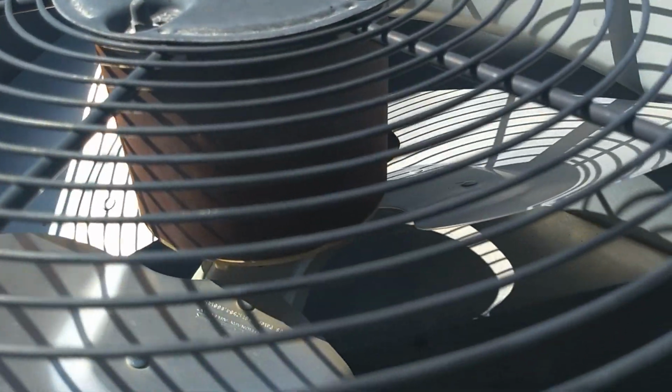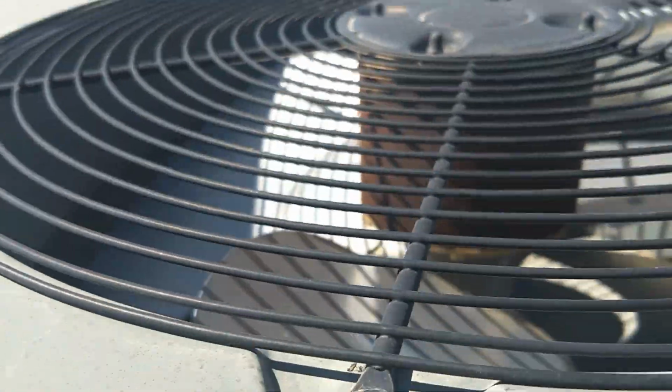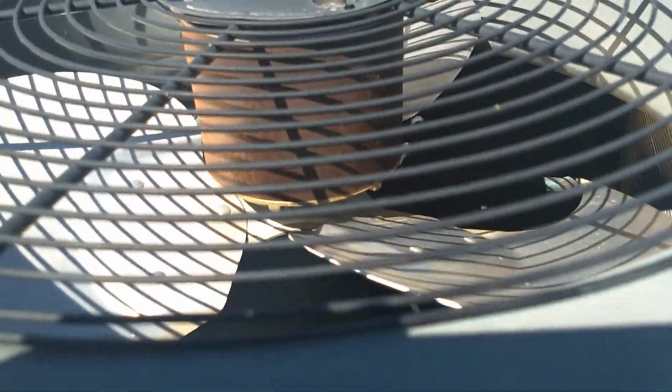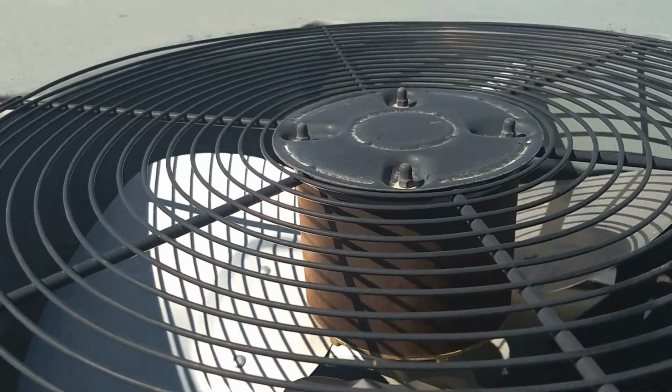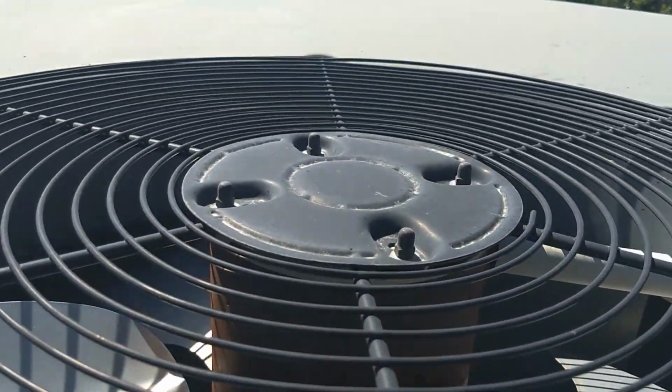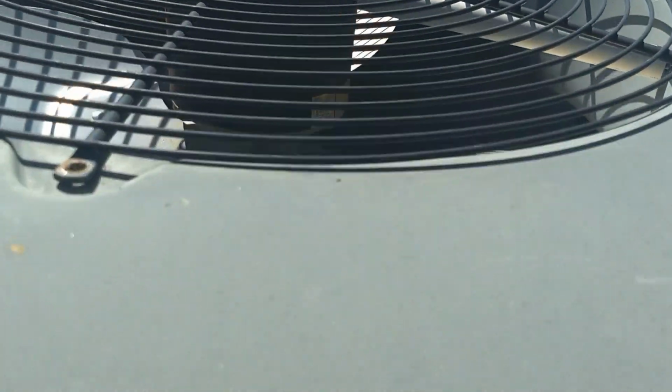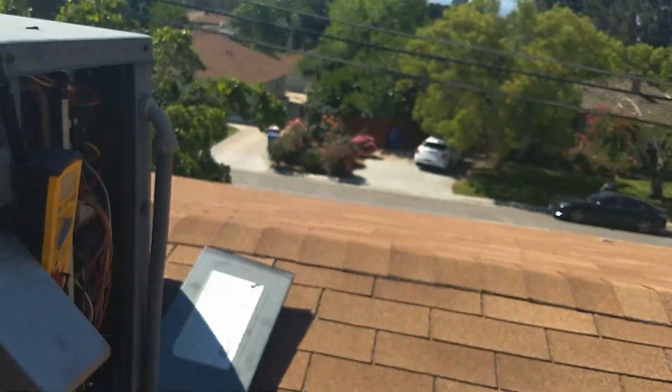Getting ready to mount the condenser fan motor, but afterthought is another thing we should have checked for was to see if the motor needs lubricating. Older condenser fan motors, and even some older machines with on the evaporator fan motor, their bearings need to be lubricated. So what you're looking for is the oil ports that you would use a Zoom Spout oiler to oil the motor with, and there aren't any. So this is a permanently lubricated bearing, so there's no need to add lubrication.